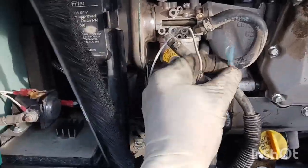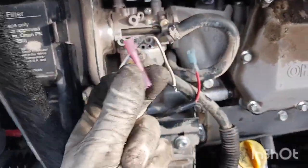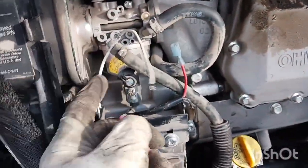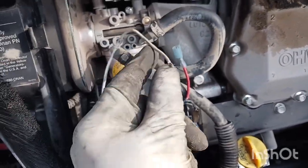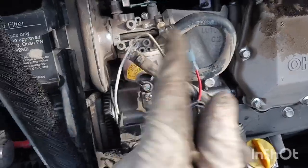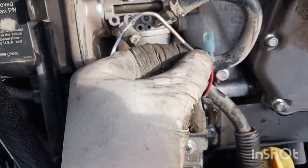What I'm going to do, like I said, is cut it off and put a straight, solid connection — that's the better way to do it. We don't need to add a fuse because if there's any back current or something, the generator generally has its own fuse inside the RV. So let's put it all together now and see what happens.